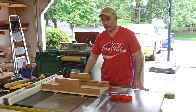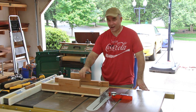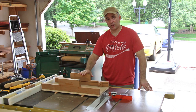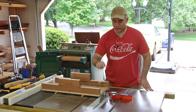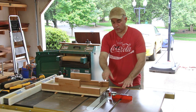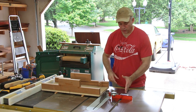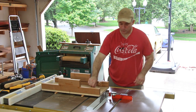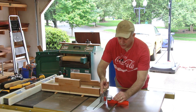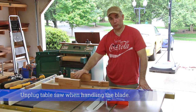As I mentioned, I've demonstrated this method before for aligning a table saw sled fence 90 degrees using a dial indicator. Probably one of the most popular criticisms I receive is that the dial indicator method is aligning the sled fence 90 degrees to the miter track, where the five-cut method is aligning the blade 90 degrees to the sled fence. But the table saw blade should already be parallel to your miter track. If you align your sled fence 90 degrees to your miter track, and the blade is parallel to the miter track, it is by default 90 degrees aligned to your table saw blade. You can easily check if your blade is parallel to the miter track with a dial indicator — mark one side of the blade with a sharpie, zero out the dial indicator, roll that dot to the back, and take another reading. If you don't read zero, your blade is not parallel to your miter track, and you need to address this before you build a table saw sled.